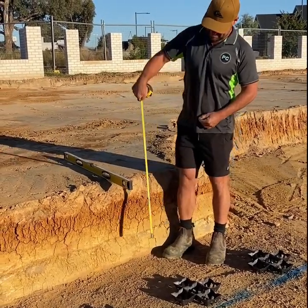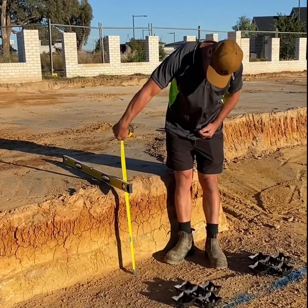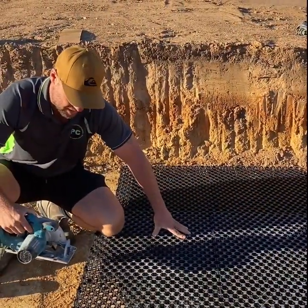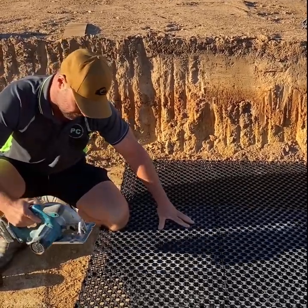At the start you want to measure the height, which is 570mm. On that first measurement you want to take 30mm off — I'll tell you why later. So we've got 570 take away 30mm which is 540, right there. We're just going to use a circular saw to cut through it.